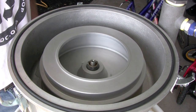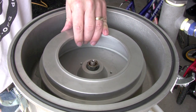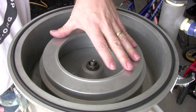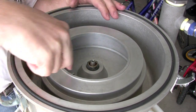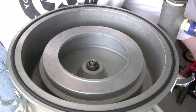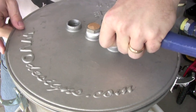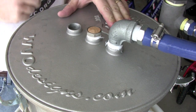Welcome to the Raw Power Centrifuge from WVO Designs. We've been testing this in our labs. It consists of a centrifuge bowl, an outer bowl, and a quick connect fitting to take the centrifuge bowl off. There are two ports — one on the outer bowl and one underneath for draining water. It also comes with a handy lid that has a dispensing port, an air breather port, and an optional port for doing all sorts of things.